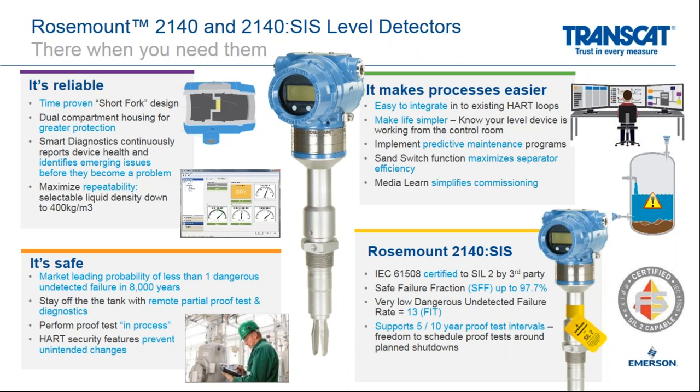So in standard conditions, it should operate around 1400 hertz when it's dry. And let's just say you map that to around 18 milliamps. You should expect your milliamp output to be 18 milliamps over time. And if you start to drop down to 16, 15, or 14, or start going up to 19, 20, or up into saturation, then you know you have a problem with your device. So again, this is all just talking about the analog signal with no digital intervention at all.